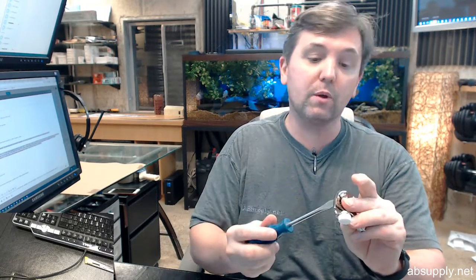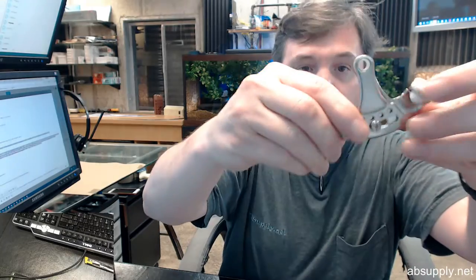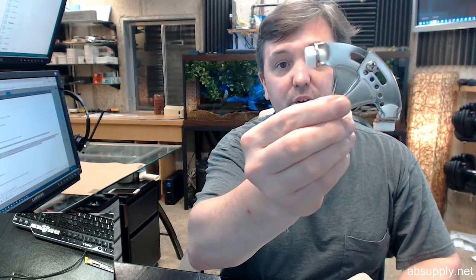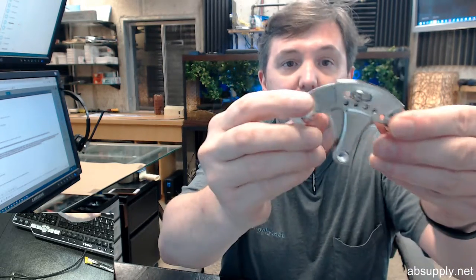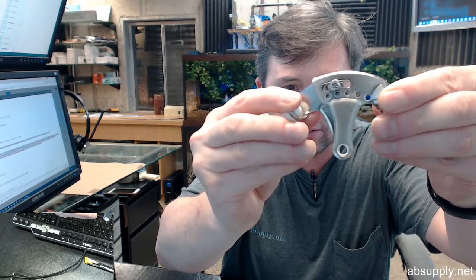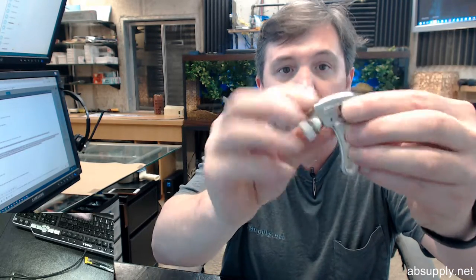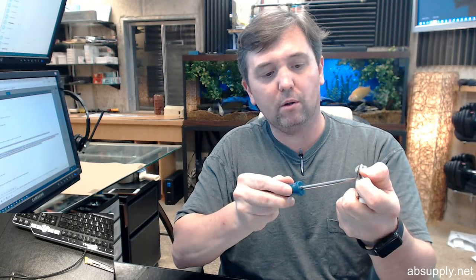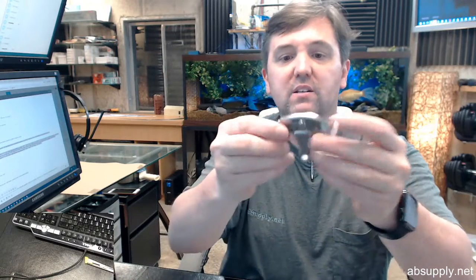Screwdriver, loosen it. Don't remove it. Just loosen it, and you can move those plates back and forth, and you can see you can bring that down to probably 80 degrees. You can move that over. That pin is going to lock or engage in the holes that are there. Okay, and when you're done, just tighten it up. You don't need too much. Just a very small turn with the screwdriver will lock it down.